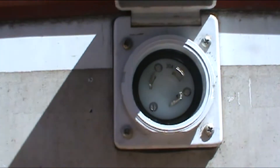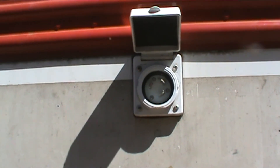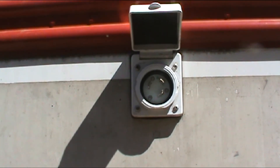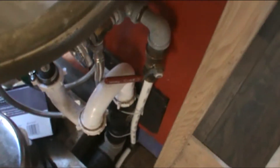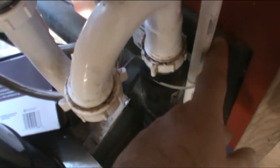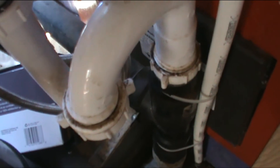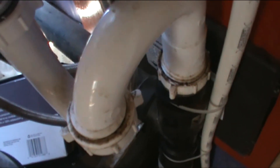This is my 30 amp inlet that I can plug into a regular RV electrical hookup — that's 110 volts AC, 30 amp. These also come in 50 amp, and if I had it to do over again, I would probably do a 50 amp, but mine's 30 amp. So if I plug this in, all the AC outlets in the bus are energized. The shore power inlet comes through here, and over behind the plumbing here is an auto transfer switch. The inlet to the shore power goes into the auto transfer switch, as well as from the inverter. It will automatically transfer between either shore power or the inverter. If I had the inverter running and I plugged in the shore power, there's a delay — I think it's 30 seconds or something. Then the auto transfer switch would automatically switch to shore power, so you won't have both of them running at the same time, which could cause issues. From there, it goes to the distribution panel.